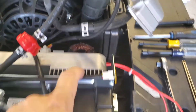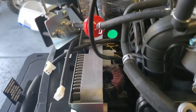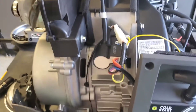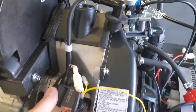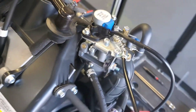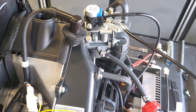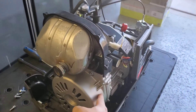We've got a nice little inverter here — it's all potted. Some components are no-name, some are good, but overall it looks decent. The cylinder is about 80cc's, and the cylinder head is actually all part of the generator structure itself — that's how they make it so compact. You've got a coil pack that fires your spark plug, and the carburetor. I want to pull that out and find out what main jet is in there so I can make altitude recommendations, but I need to get some hours on this generator first to see if it runs rich or lean at my current altitude.